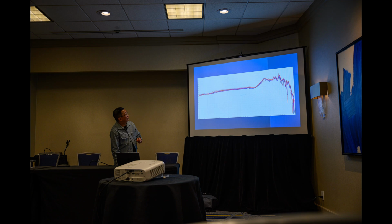And I've been slagged on for normalizing where I want to normalize. But guess what? Matching at one frequency, which is why we use noise now. I don't even know if we're going to stick with that, but I'm trying to find something that's more representative of just using a single tone, whether it's 1 Pascal at 500 hertz, 90 dB at 1K, and just lining it up there, and then people making comparisons.